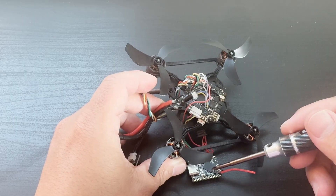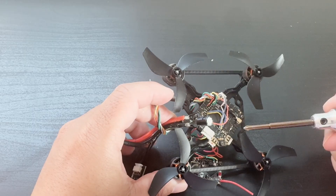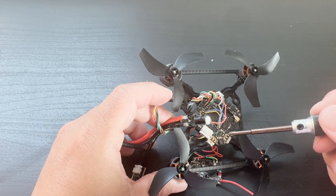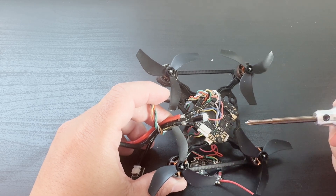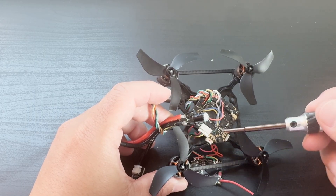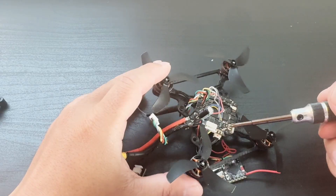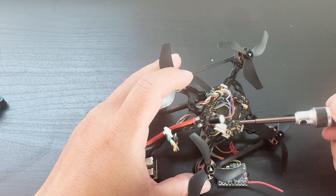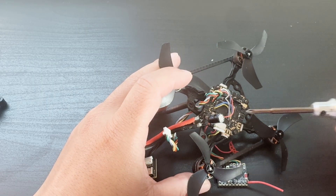The drone bridge is an ESP32 S3 development board. One tricky thing is that this board does not break out the I2C pins, which are normally used to connect to the compass. The good news is there is a special release of the ArduPilot firmware which can use one of the UARTs as an I2C connector. The drawback is that that GPIO was originally used to connect the onboard ExpressLRS receiver to the MCU.